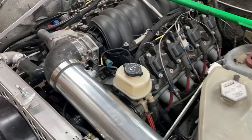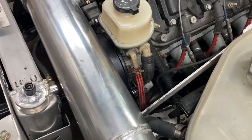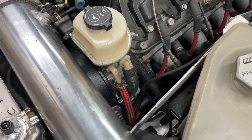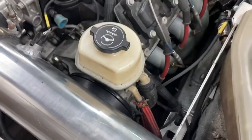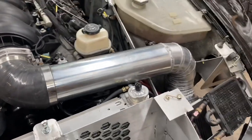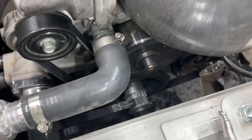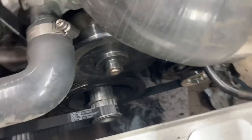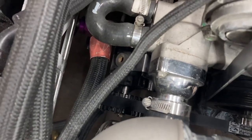In the top of the engine bay, you've got a better look at the CTS-V power steering pump. For the high pressure line, it connects to the high pressure of the rack, and the low pressure return goes to a little cooler to cool the power steering fluid, then back to the reservoir. That's kind of behind the intake pipe, which is getting engine air from the side of the nose right under that cooler — up the pipe through the elbow and into the intake manifold. You can see the belt routing and how the oil pump is driven off the geared pulley on the front of the harmonic damper on the main crank. You can see the drive for that oil pump down there.